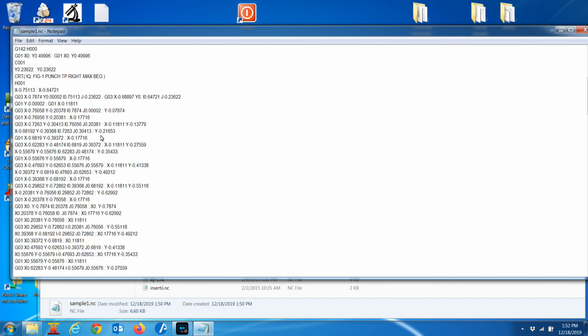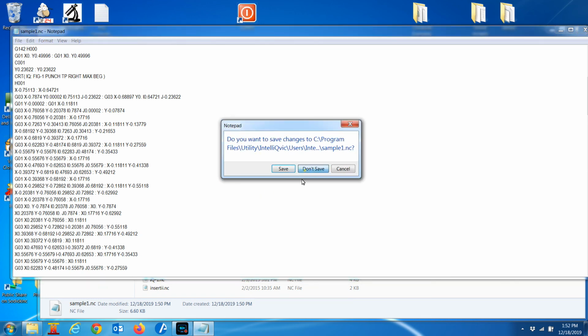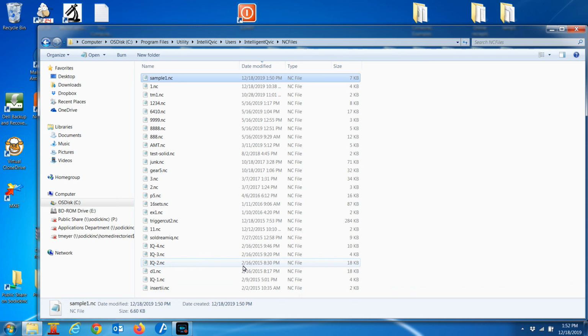It's a unique format for 4-axis on wire EDM. We've been doing it this style for over 20 years now. So it gives you true geometry for 4-axis, because a circle or a corner radius is a G03 or a G02 code instead of broken up into, maybe 10 or 15 straight line moves. So that's example 1, 4-axis punch example.